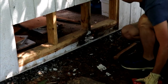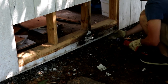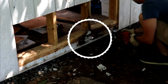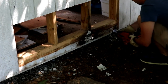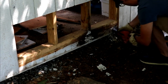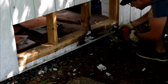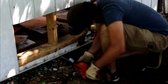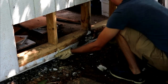At this point I realized the demolition was not quite done. When I got that siding off, I realized that the main band board that the bottom of all the siding is nailed to was rotten away in this area. Rot begets more rot, so I want to get at least as much as I can reasonably out of there. I reached underneath and felt where the main cross members were, and used my sawzall to cut right along the edge of where that band board sticks out.